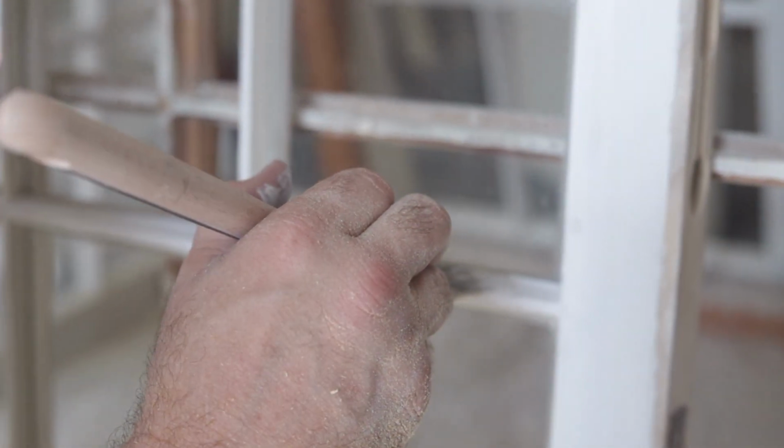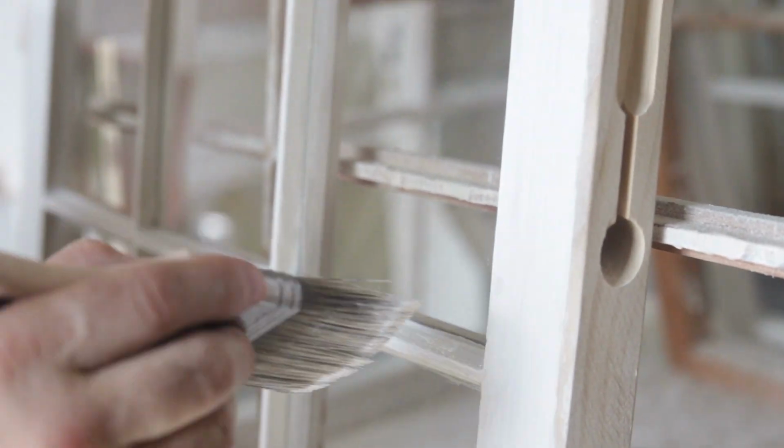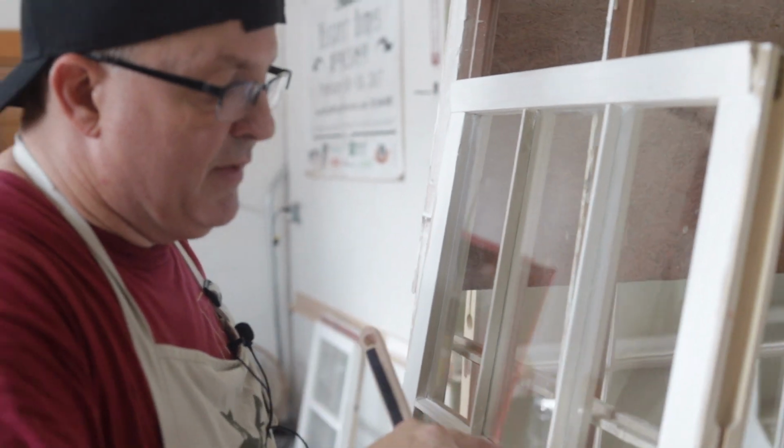Modern painters, when they paint something like this, put the blue tape on there or some kind of mask, and then they paint all of that. Then they cut it with their razor blade and compromise that paint seal, and that lets water in. Modern paint films are so good that they keep water out really well, but they also keep water in really well. So if your paint job allows water to get inside, then it's worthless. You can use the cheapest paint and paint correctly, and that will be better than the most expensive and best paint painted incorrectly.